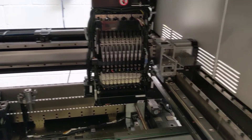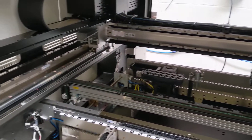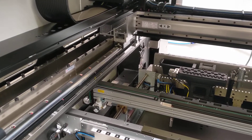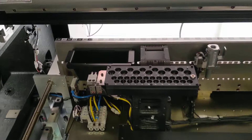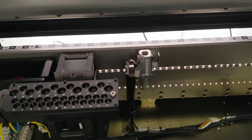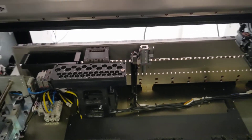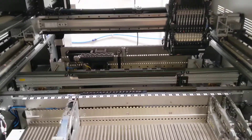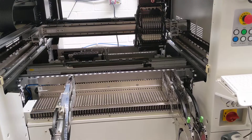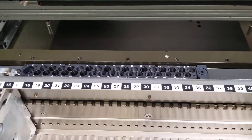10-head flying vision machine, linear motors on the Y-axis - it's quiet, it's clean, no maintenance needed on linear motors. Stage camera for large components, air shower cleans the nozzles for very small components. This machine is capable of placing 0.3 by 0.15 components - that's super, super small.